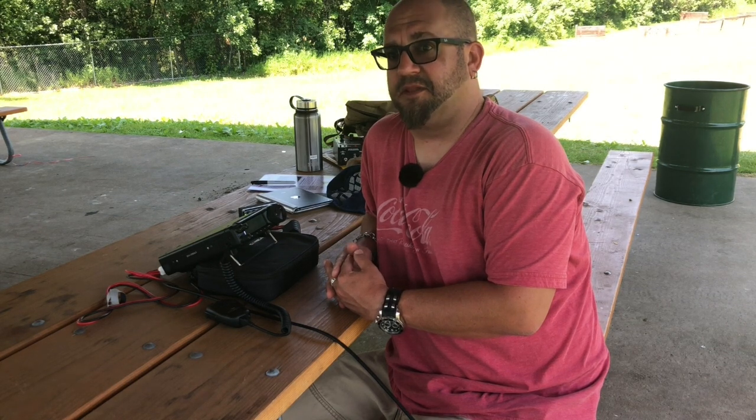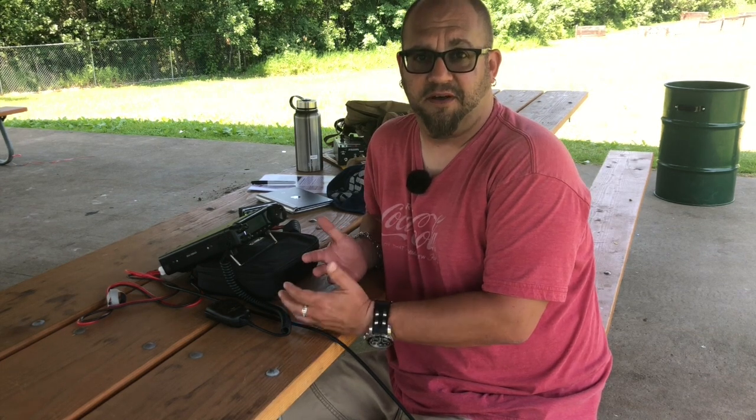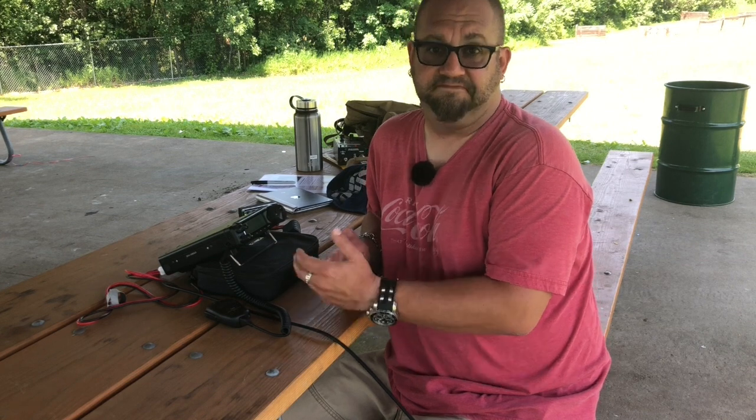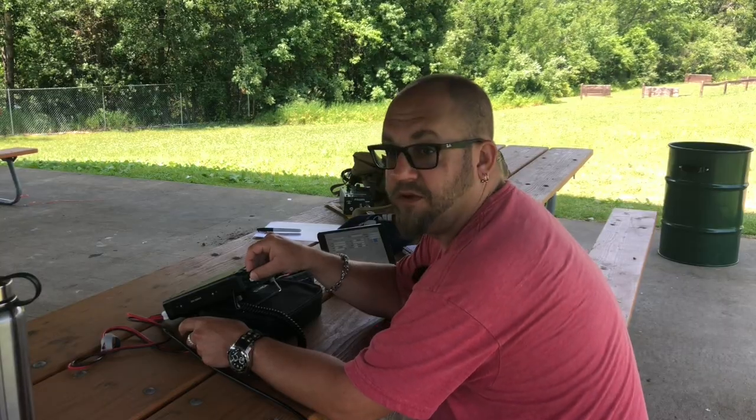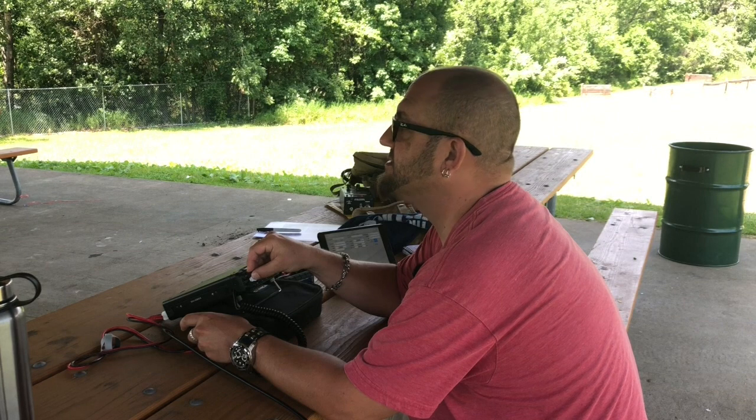You don't have to get up and change anything, you can just sit here and operate — although QRP. They do make a high power version of this as well though. So first impressions, I think it's pretty neat. It's a little harder to set up, it takes a little bit longer — but again, that's one of the compromises when you're playing with an antenna like this. So I'm going to tune around here and see if I can make a contact or two on 5 or 10 watts. Here's a guy calling CQ Canada Day — he's got a booming 20 over signal. Let's see if we can get him.